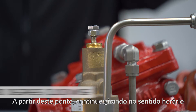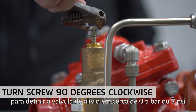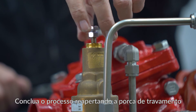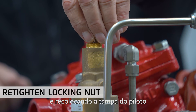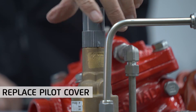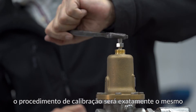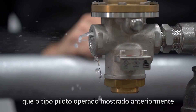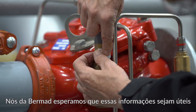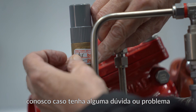From this point, continue turning clockwise a quarter of a turn or 90 degrees to set the relief valve at about 0.5 bar or 7 psi above the reducing valve outlet pressure. Finish the process by re-tightening the locking nut and replacing the pilot cover. The relief valve calibration is now complete. Where the relief valve is of the smaller direct acting type, the calibration procedure will be exactly the same as the previously shown pilot operated type. We at Bermad hope you find this information useful and invite you to contact us with any questions or issues you encounter. Thanks for watching.